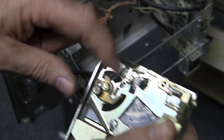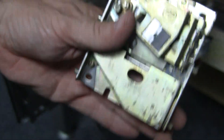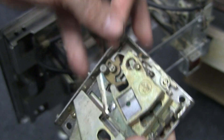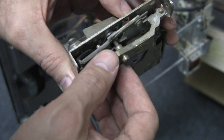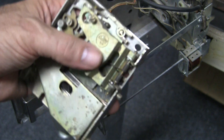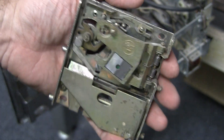So you have a couple of main functions. You've got this little weighted sized piece here that helps differentiate the coin, and if the wrong kind of coin goes through it goes a different way — it kicks it out to this larger ramp here which filters it over to the eject side. If you put something in here that has a high iron content, it's going to get stuck on the magnet — it'll go in and stick. In which case you'll have to eject it, and there's the eject button right here. When you hit that it partially opens up the inside of the mech, pushing the coin away from the magnet so it can drop and clear. Although I have seen certain coins that may be magnetized — some Canadian quarters have so much magnetism that sometimes they'll stick in certain mechs and the only way to get it out is to open it up and take it physically off the magnet.